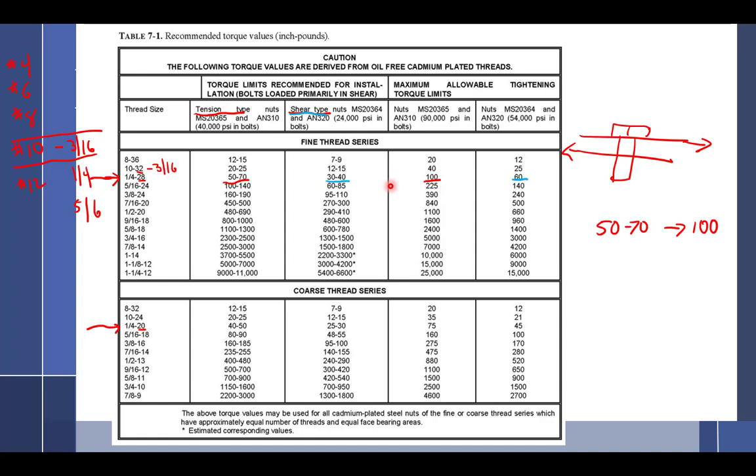And there's two ways to figure out how much pull is on there. One way to do it, and Lycoming does this with their really high-end, high horsepower engines on the connecting rods, is they're machined on both ends and you use a micrometer. You torque it to a certain point, but from there on out, you turn it and measure it, and you're seeing how far you're stretching that bolt. That's really what you're after. So in a perfect world, we wouldn't have torque wrenches. Every single bolt would have machined surfaces, and we'd use a micrometer to see how tight it was. But of course, it's not necessary.